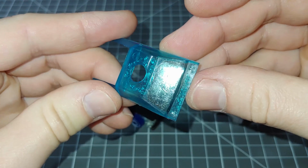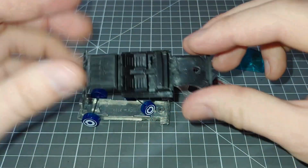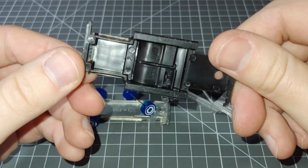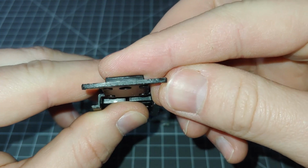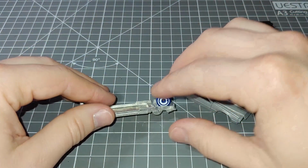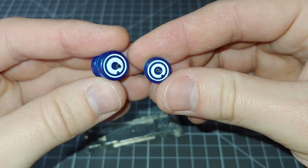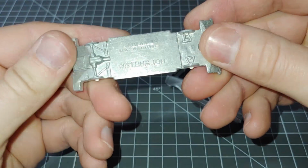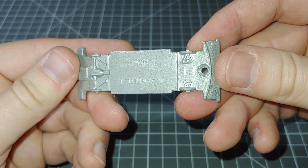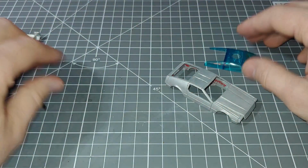I also placed the metal parts into a little jar and just put some limescale remover, which you generally just use for like your bathrooms or kitchens, and just let it sit in there for about 5 minutes. It removed most of the oxidation on the metal parts and came up a lot smoother than they initially started. Made sure to give them a bloody good clean afterwards because the limescale remover will continually eat into the metal if left on there.